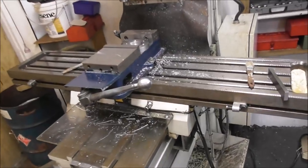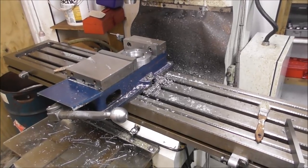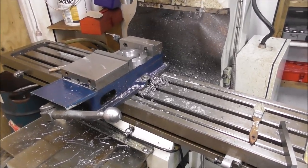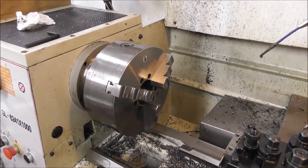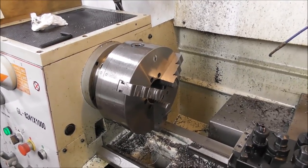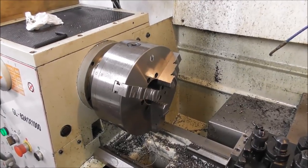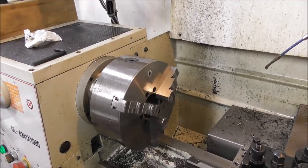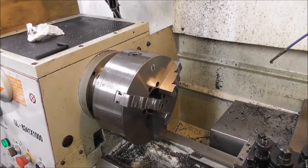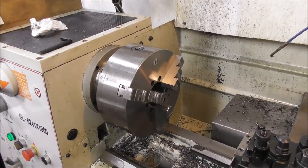I mean, that's the same system that a vise is held on the table. It's surface clamped down on the table. Usually it's not keyed at all, but just two bolts. So a big flat area does grip really well. All the same, do think about safety. You know, I'd hate there to ever be an accident. If you're at all concerned, put a location spigot in the back and just give it enough clearance for adjustment. So if there ever was an accident, it could only shift a small amount and still be contained within the spigot.